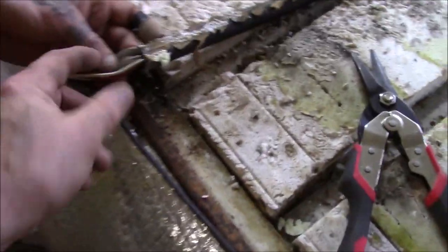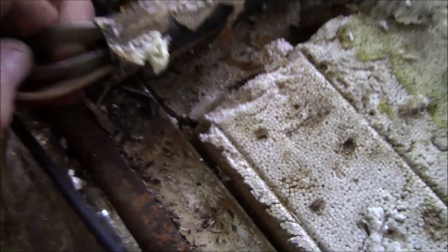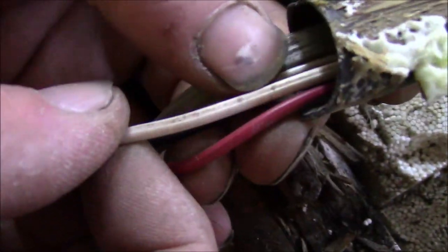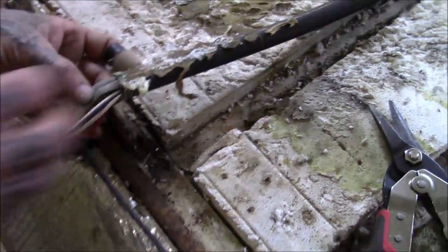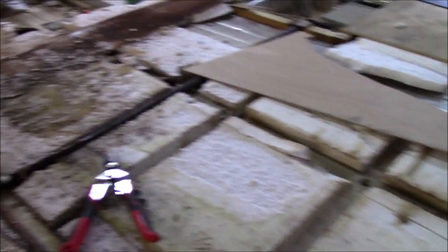We had all these wires going through and we wanted to put plates on them. We got lucky — or maybe not so lucky. This is a communication wire for the air conditioner, and we want to make sure it's not breached, but the staple did go right through it. I believe it hit this white one as well. There are a couple more staples right there. If those conductors are separated they'll be fine, as long as the staple didn't push a strand across to bridge them — that's what we're concerned about right now. You can see we've ripped everything up and are going to redeck all this.